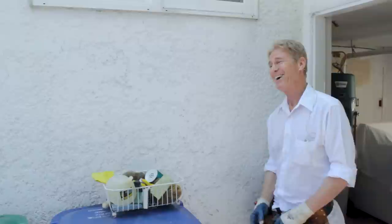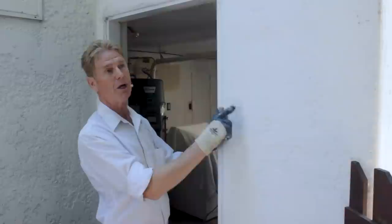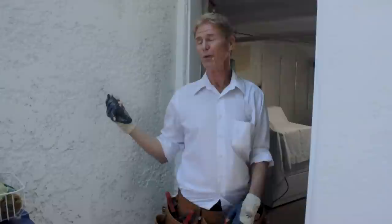35 years ago we did this. When I did that, I told them: this has been painted at least 20 times. Every 10 years you should prime something and paint it, and every time you do that it softens it. So this is very soft. This is a knockdown dash. But this section is fresher because it's only been painted a couple of times. When you're trying to soften something, use a big fat nap roller.